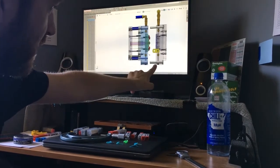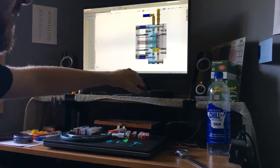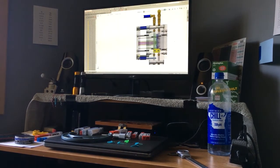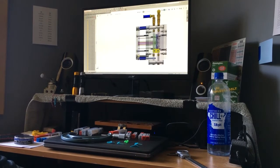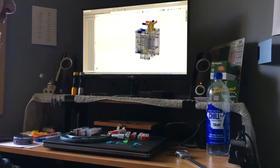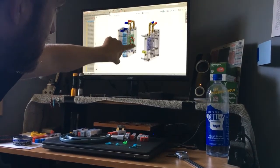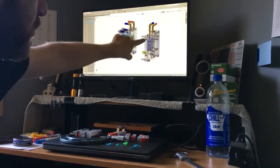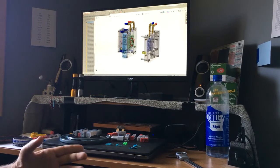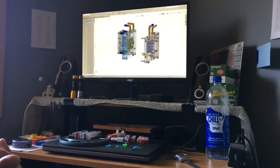When the tool closes, the press closes the tool and the leader pins engage the bushings, holding everything much more accurately so the cavities line up better. There are other ways to enhance that further if needed. The tool also needs to remain at a constant temperature while molding parts. You'll notice these water lines that come in and essentially surround the working area — we have the same thing on both sides — which keeps our environment very repeatable.